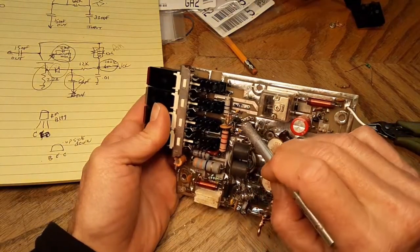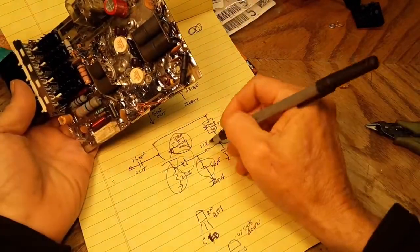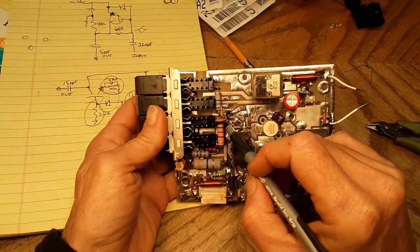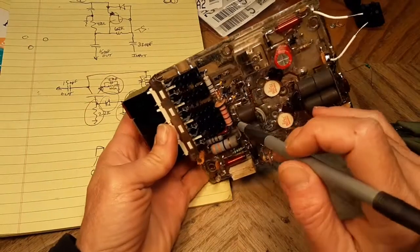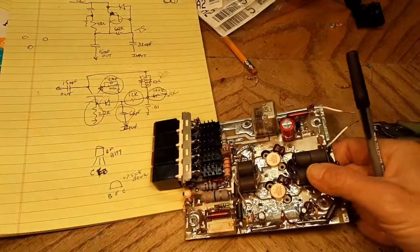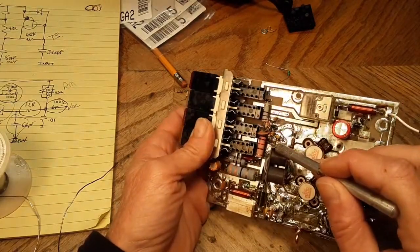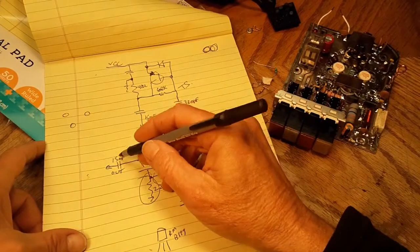The 12k is tacked across up to the VCC point right here. Now we need a bypass capacitor - there is one elsewhere but it's a long story why I couldn't use it. I'm going to add another one from this point back over to ground. It's mounted upside down from the VCC connection right here back down to the same common ground path I've been using all along. That's out of the equation.